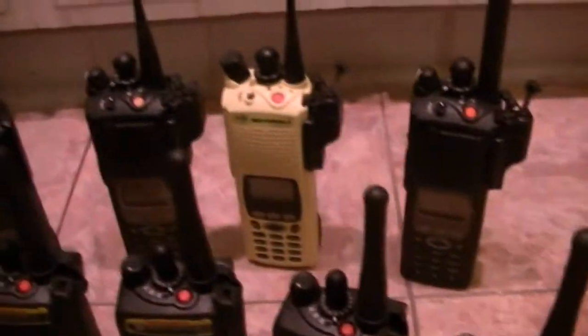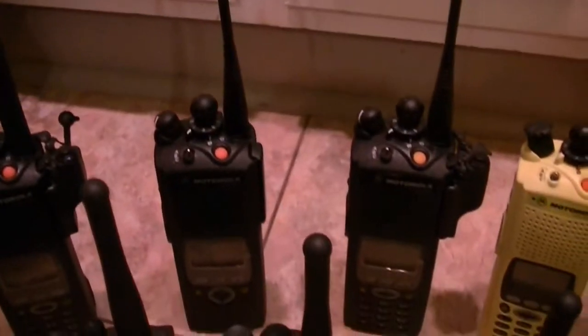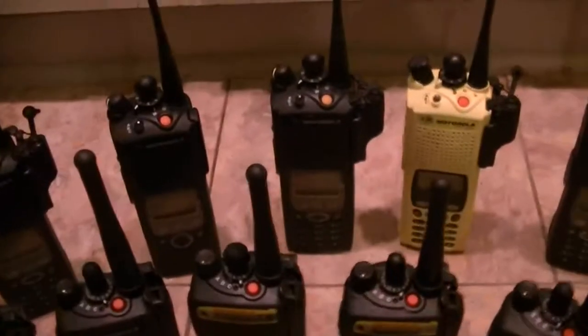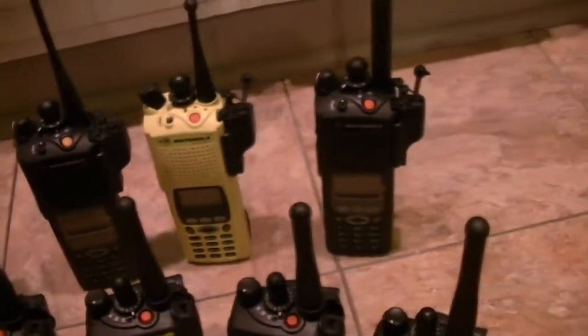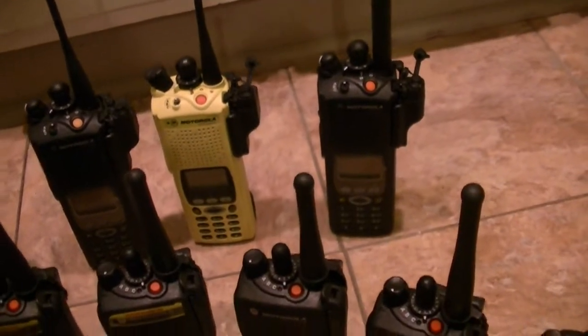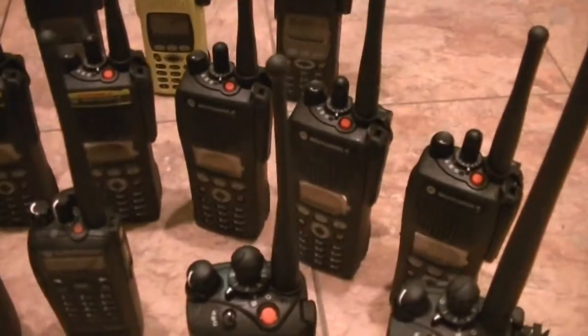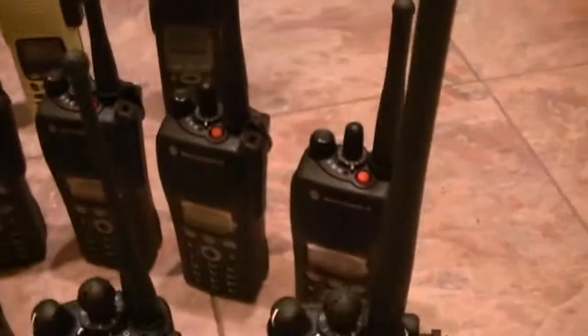Well, just been pretty busy, as you can tell. Just got some radios in, and I just got some radios converted. In the back tier, in the back you see a VHF, 800 megahertz. These are all 5K model 3s. Another VHF, another 800. They all have 9600 baud, that's a VHF. All the VHFs and UHFs have FPP programmed into them, with the exception of the Mototrbos.